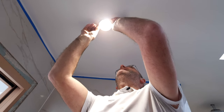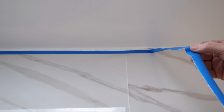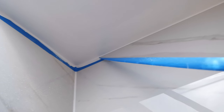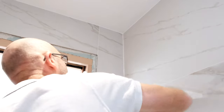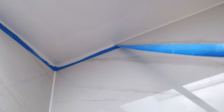We've got our recessed lights back in — now we should have a nice clean line. There you go guys — there was an easy way of painting a ceiling two coats, with the de-nib in between, using durable matte paint for the bathroom. Using the clean edge tape against the tile so you can get a nice clean edge. If you enjoyed the video, like and subscribe below. You've been watching Build with A&H.